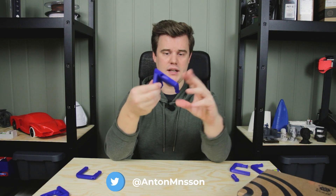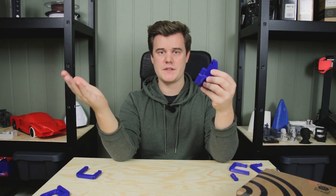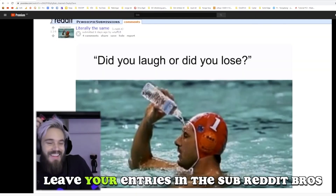Here it is printed and ready — a wall mount. You can see the screws are a bit offset, which helps with side loads. I want to keep it pretty narrow so it's not too visible. It's a pretty simple but clever design — the screw hole helps with extra shell layers in the X/Y direction. I'm not using the internal screw for now, but I can add that to the design if needed. The design is still pretty simple. I'm not sure how well the PLA will hold up over a few months under static stress, so we'll start with this and see how it behaves compared to breaking it on the test stand.